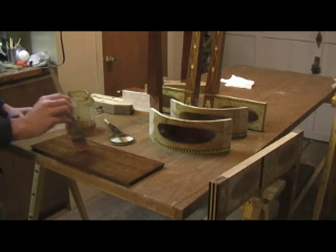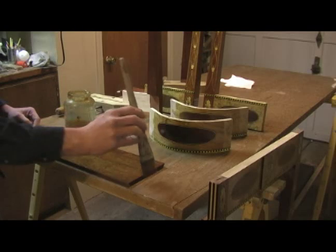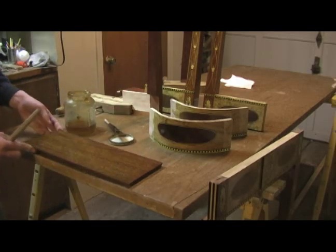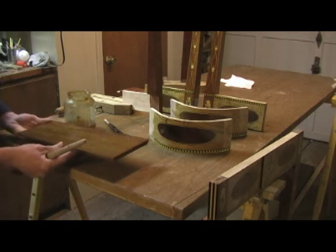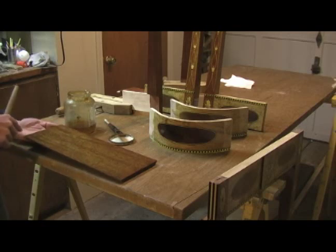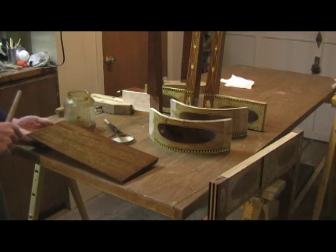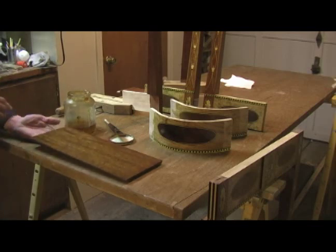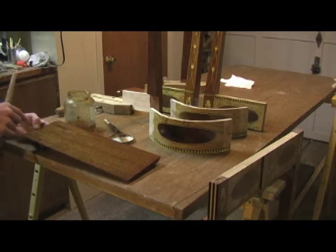Because it's cool and this is a very small piece, I can go back and almost tip it off like you would varnish. Now that has a good smooth even coat. It's going to look quite wet and wrinkled even after the final coat, but that will be taken care of in the rub-out stage. My rule of thumb to stop is when an additional coat adds no more gloss — at that point you're getting diminishing returns, and that's when I stop.